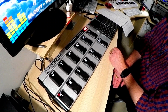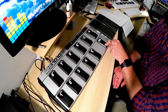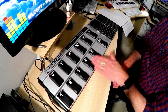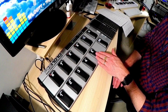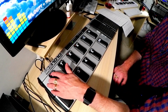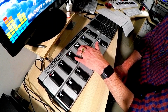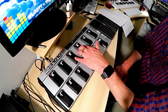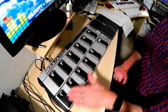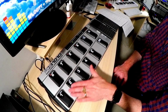The key things to remember are, number 1, when you're in programming mode, which I'll put it back into now, you only want lights lit up on the things that you're going to program. So for example, I have this set up so that I'm sending out one control message, which is done using button number 6, and I'm sending out an expression pedal A and expression pedal B to control the super knob and the modulation wheel. All these other buttons, which can perform other functions, none of them are turned on. If they are, it'll confuse things and you'll get some weird behaviour.